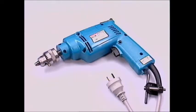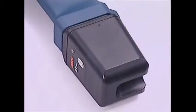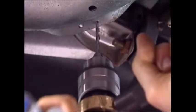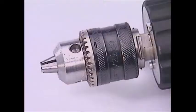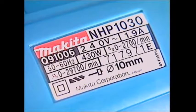This is a portable drill — this one has a cord you have to plug into an electrical supply. Cordless models use their own internal batteries. When you can't bring the work to the drill, you can take this drill to the work, but don't expect it to put large holes through very hard metal. The biggest drill bit that'll fit in the chuck is usually marked on the body of the drill, along with the speeds at which it turns. There are usually two speeds, but some drills can be set to any speed within their range.